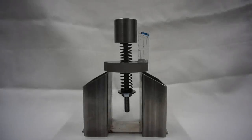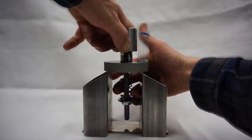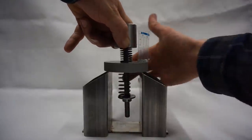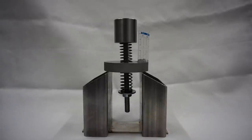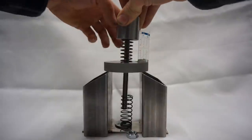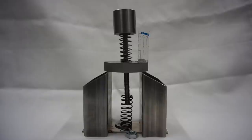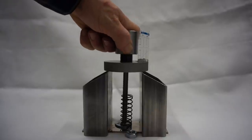What I also want you to note is that our chuck deflection in the design case with maximum external load is at roughly, I would say, 16 millimeters. And this is 16 millimeters away from the preload position. And this preload position, 32 millimeters, is also 16 millimeters away from the unpreloaded position. So we have pretty much equal distances: unpreloaded case to the preloaded case, and then to the case of maximum external load.